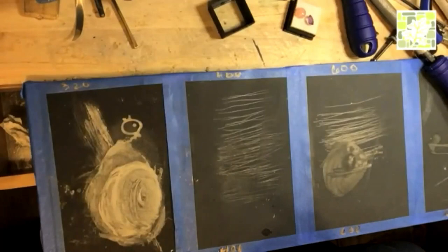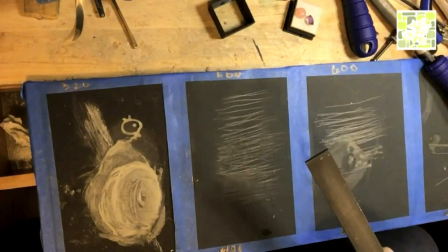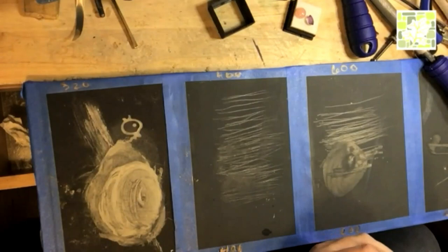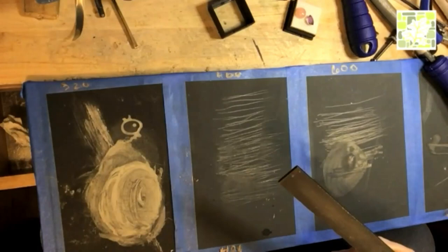I actually meant the flux can act as a paste. If you're using the Grifflex flux or something like that, that acts as a glue to stick down your solder. Now, it's not really good enough. I managed to knock everything loose tonight. Got it. Okay, then yes, maybe the paste solder, just know that even if it hardens on you, you can reconstitute it. It's bloody expensive, paste solder is, and it's hard to control your amounts. So your trick is going to be using a pin or something to take little bits off of the tube. But even if the tube dries out, there are ways to reconstitute it.